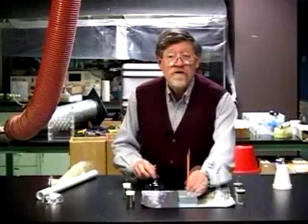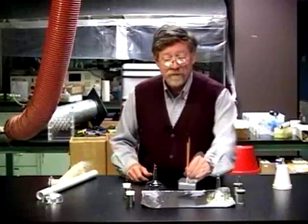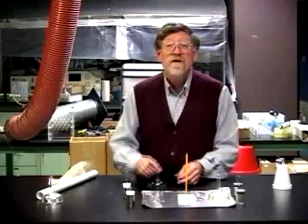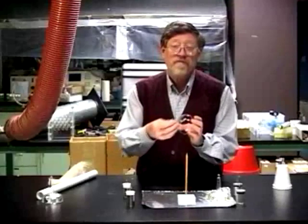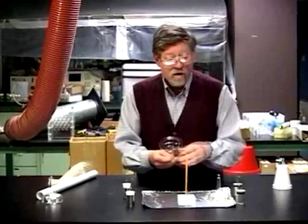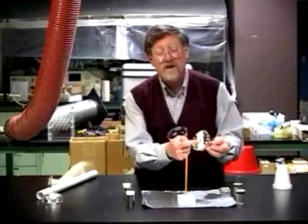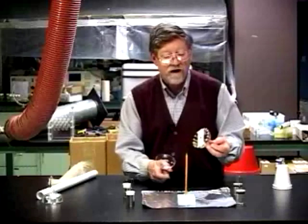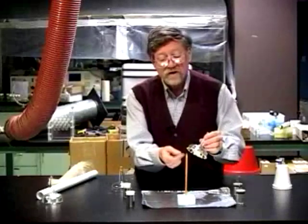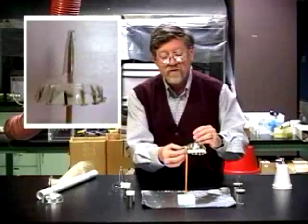We're going to make a pivot for the electrostatic motor out of a piece of foam and a sharpened pencil, setting that on an aluminum foil base. The rotor is made from the top of a plastic champagne cup. Across the bottom of the champagne cup, we mount a strip of paper with a hole in the center to act as a lower bearing. We have put brass fasteners on the rim, spaced around it.